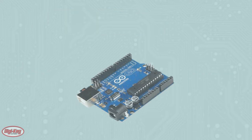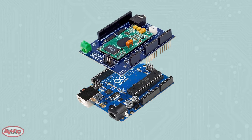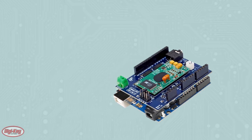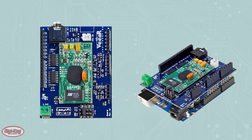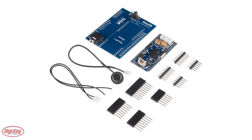The Shield is a rather versatile command parsing system where predetermined commands can be spoken and the results sent to the Arduino for further processing. For this video, we will only be using the module as an add-on to the Arduino Uno. One thing to note when using the Easy VR Shield is the headers need to be soldered to both the Easy VR board and the shield that connects to the Arduino. Just be careful since this can potentially break the Easy VR via thermal damage.